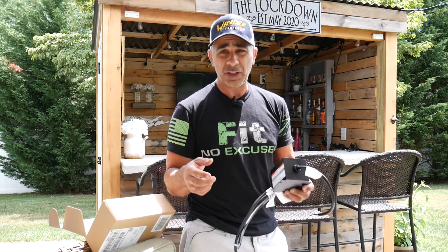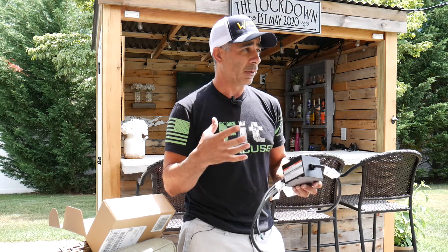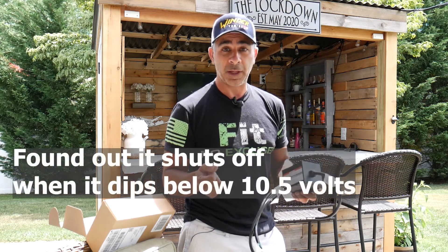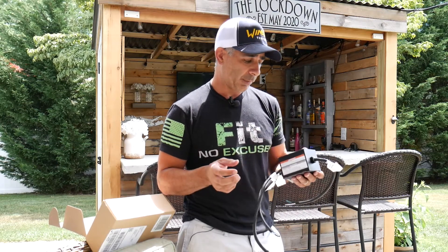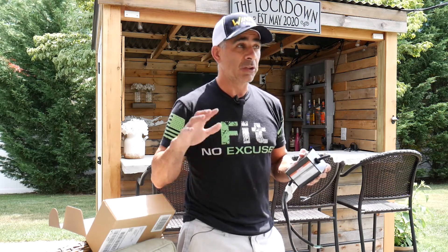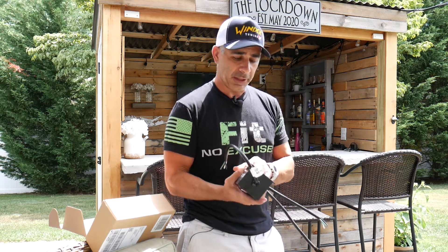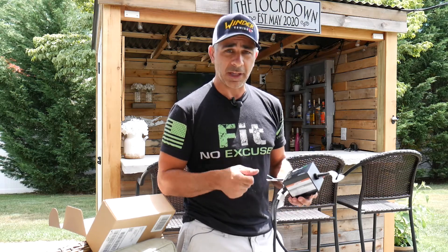I could also have it so that I keep the inverter on all the time. The inverter is set so when it goes below a certain voltage — if the battery starts running low and dips below a certain voltage — the inverter will automatically shut off. And once the inverter shuts off, that would automatically cause this to switch over to house power. But I don't want to leave it on like that because I don't like draining the battery that much — I don't want to kill it. So I'd rather just do it manually. When I want to switch to house power, just turn off the inverter and it'll go.